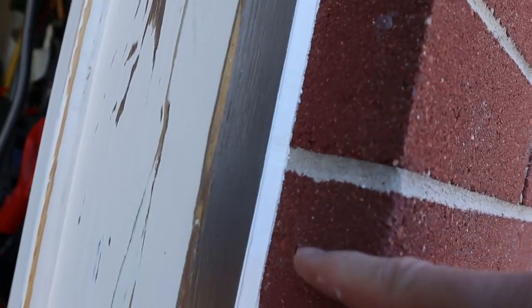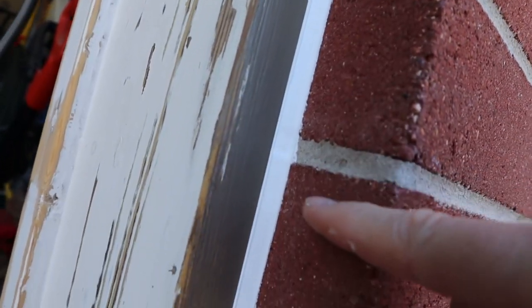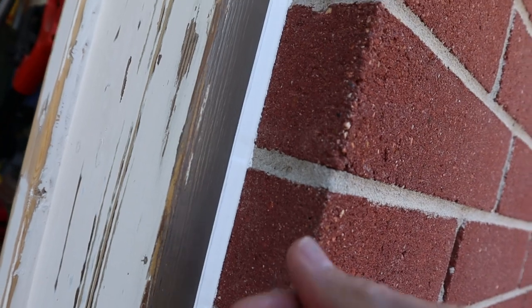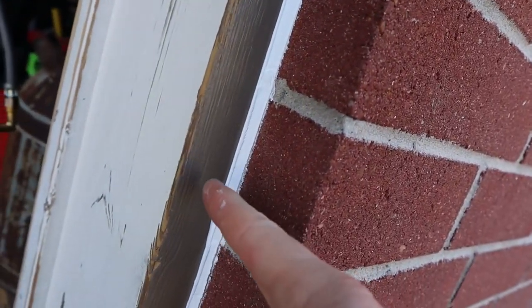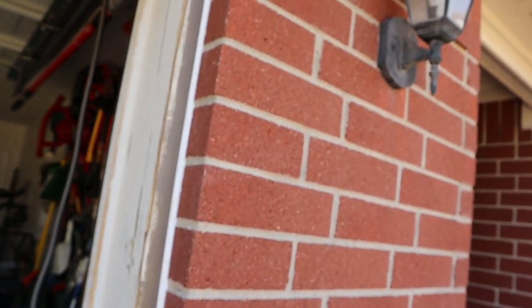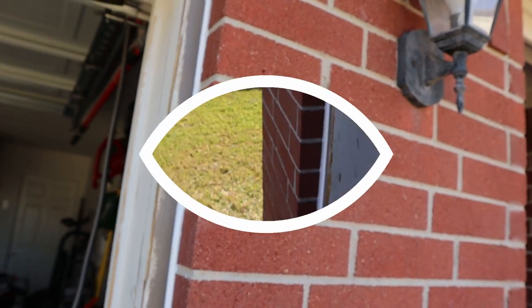And as we get into here, you can see there got less buildup on the edge. Actually got a little more on that side. Again, it's because of how the angle is. The tool itself, I make sure that it's flat against here and against here. But as it comes down and the angle changes, because it's not perfectly 90 all the way down, it rotates it. See, I got more buildup here and all the way down. So I'm pretty happy with that. Actually, I'm real happy with that. So when it dries and shrinks over the next couple weeks, that'll pull back in there and look just fine.